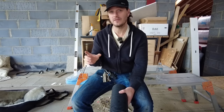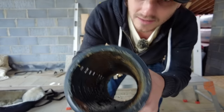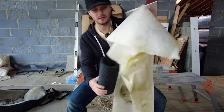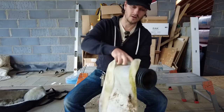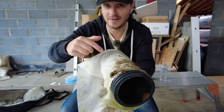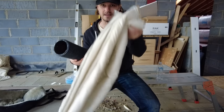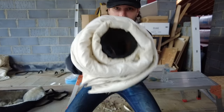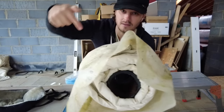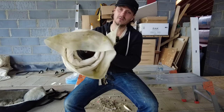A common query with French drains is whether you should use a sock or not. I actually use something called a twin wall land drain — it's perforated all the way around and very strong. This is a geotextile non-woven fabric; the sock wraps around the pipe itself, and you put gravel all the way around. Now this geotextile membrane will get blocked eventually, but you want to prolong that timeframe. You should do what's called a burrito — the membrane goes around both the gravel and the pipe, which massively increases the surface area compared to a direct pipe sock, prolonging the life of your French drains.